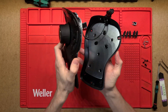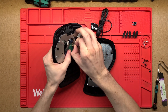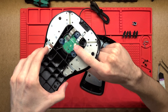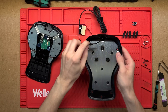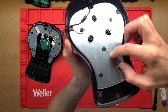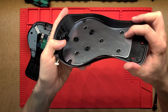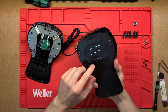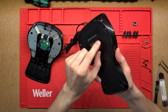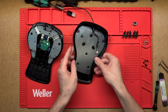That's just loosened the two sides, so the top cover's come off and we've got the top plate and bottom plate. I'll take this USB cable off — it comes in through a little hole on the bottom and plugs into the PCB. The base plate is really just a piece of plastic, and then there's a piece of metal on top that acts as a weight — glued down and held in by standoffs — giving it a really nice solid base so the mouse stays sturdy as you move it.